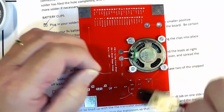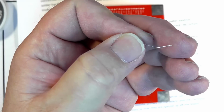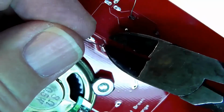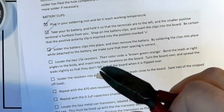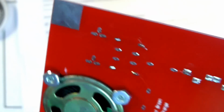Hold on to the wire as you cut it off. The reason that you do that is twofold. One, we're going to need 2 of these. And second, if you don't, that little lead can go flying and end up who knows where. You could step on it and then it's in your foot, or it could go in somebody's eye. So gently hold on to the lead and you snip right down all the way at the base, just above that solder joint. See? All right. There. Okay.